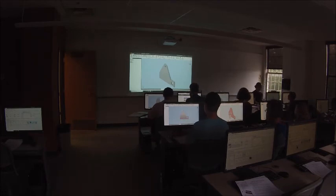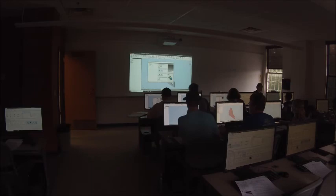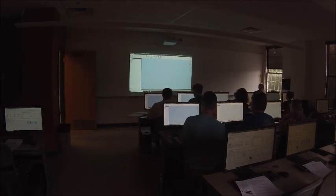Assembly together. So create a new assembly, just a standard.iam, this guy right here. So create. F6 is the same as clicking this little house button, because for some reason in an assembly it always starts you in the front view, which I never want. I want to go into the isometric view. So either click the house or hit F6 every time you start a new assembly, just do it.